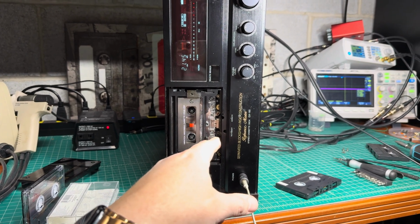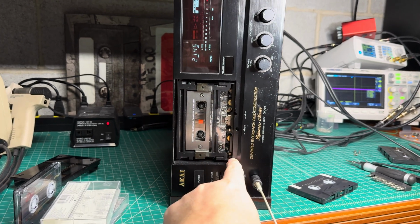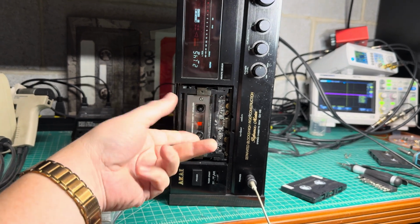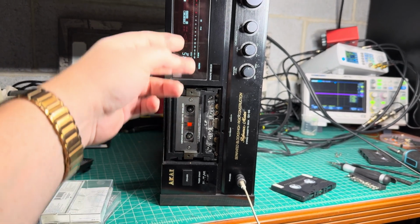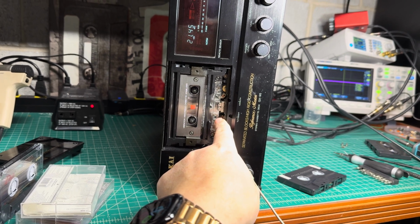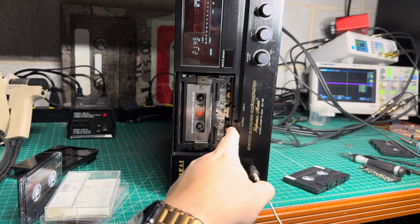And as a result, it was rising differently. I had to readjust the left guide. I put it in the position where the tape goes directly in the middle, because when I record one side, then reverse and record the other side, and then reverse and play it back, I think the right channel was losing 2-3 decibels. So I made this guide so the tape goes straight through the middle of the record head, because there is no height adjustment for this head, and then readjusted this head again, realigned everything and so on.